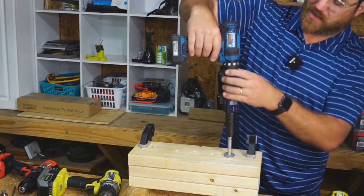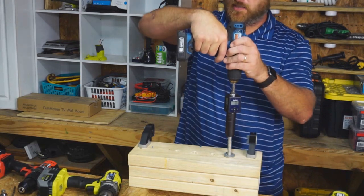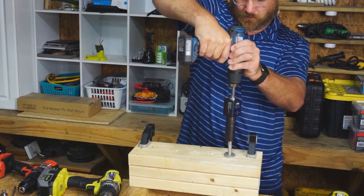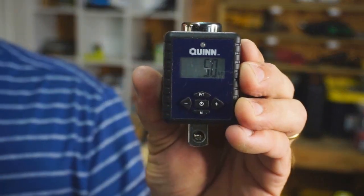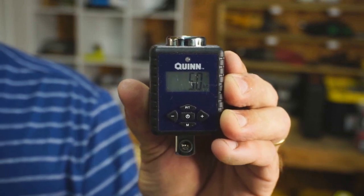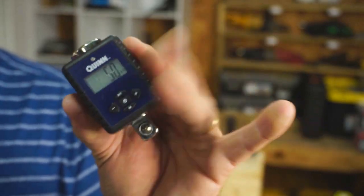Put it in first gear, set it in drill mode. I just pray it doesn't smoke, because that's why I'm not using a Ridgid — the Ridgid was starting to smoke again, probably. Just five foot-pounds from the Hercules, roughly 60 inch-pounds of torque. Not a whole lot of torque at all. It does really small tasks really well, but they're going to have to be really small tasks.